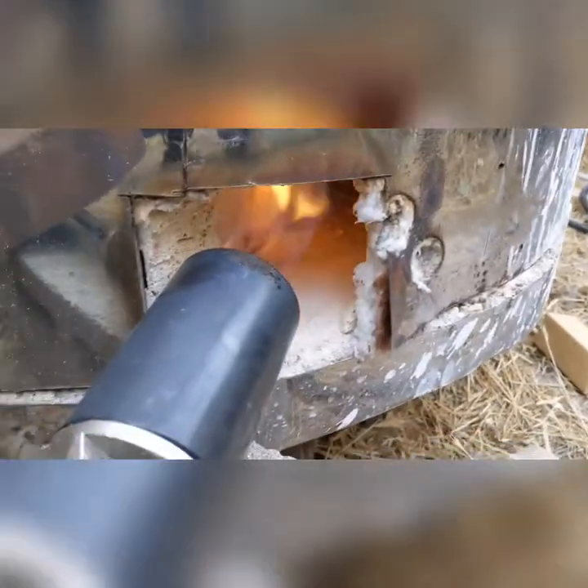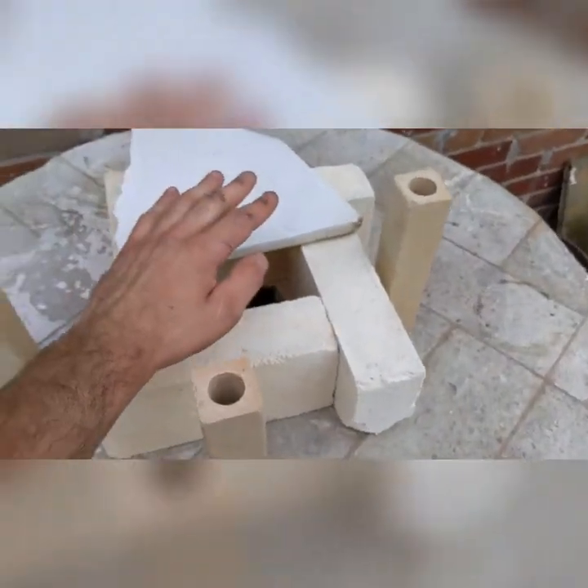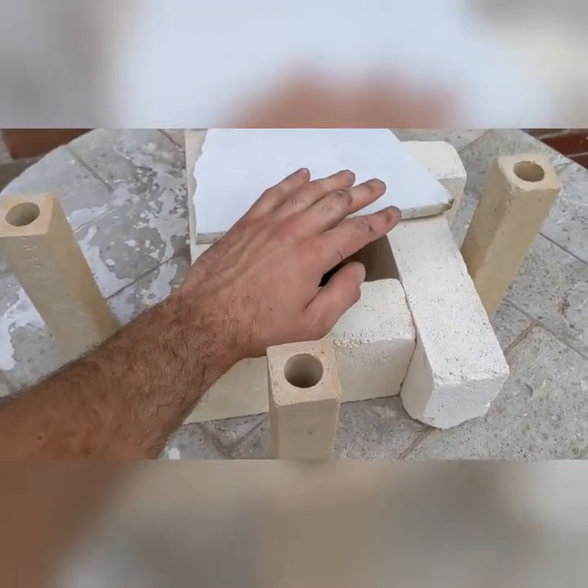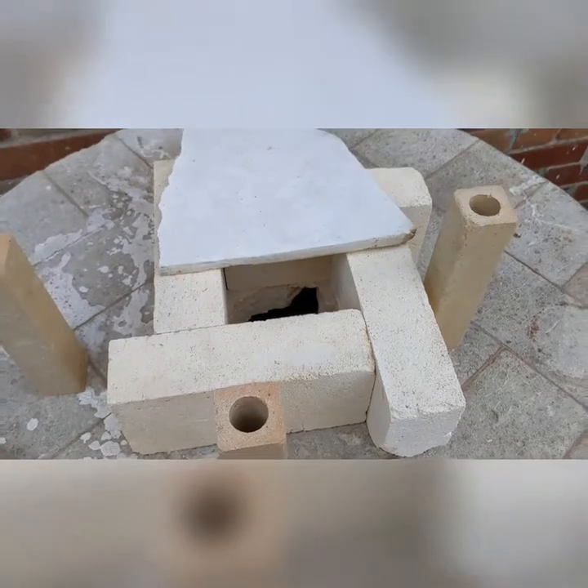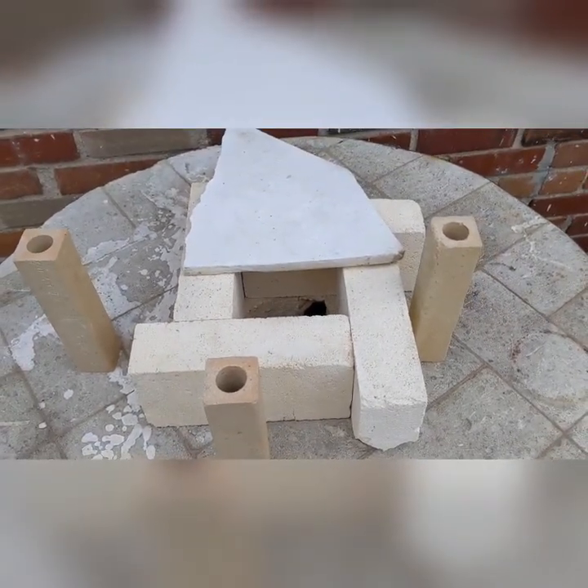There's very, very little fire in the burner ports — I've got it on the light flame. I'm just going to slowly creep through this range from 200 to 300 degrees over the next hour or so, just to make sure everything is really dry before I start to increase the temperature.